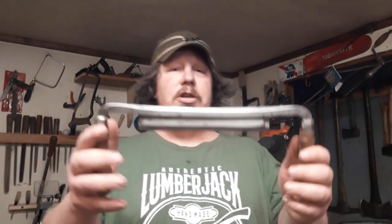Hey guys, Jamie here with Journey North, just working in the shop tonight. I got a newer old draw knife — an 8-inch Oak Leaf, that's the brand I collect — it's in the EC Simmons catalog. I'll look it up and put a picture here for you. I'm just tuning it up a little bit; it had a pretty bad edge on it, somebody was a big fan of the flap disc to try to sharpen it. I put a clean edge on it and thought I'd show you a few tips on using these when you're hanging an axe.